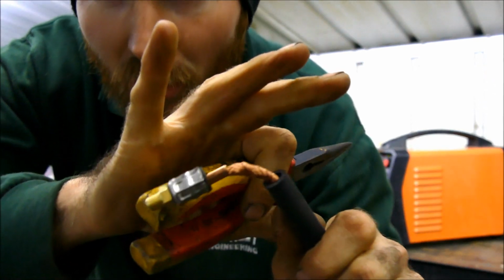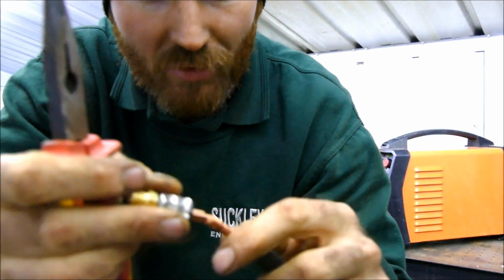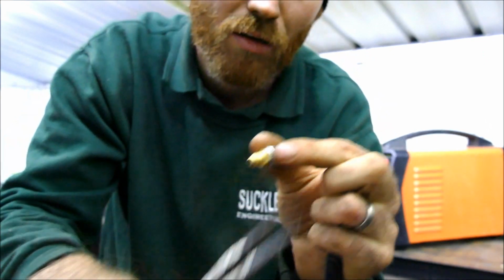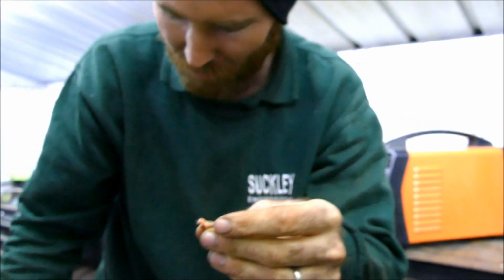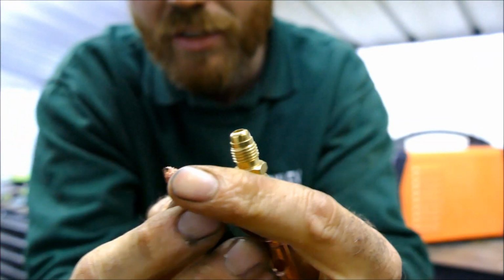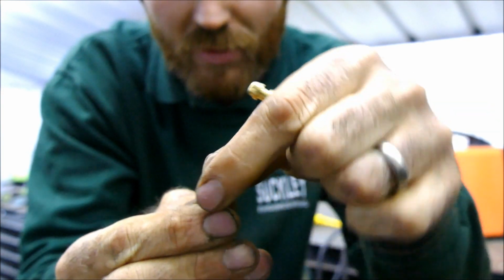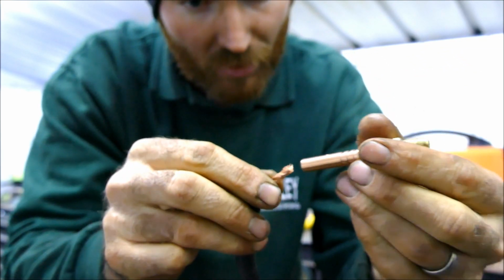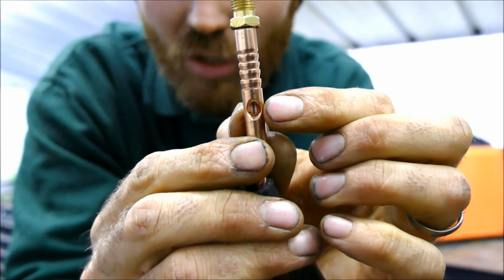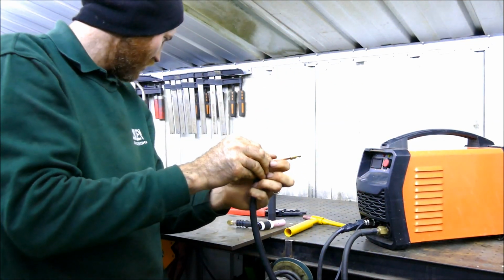There you go. So already I've got the Stanley knife and I've cut around the pipe just to reveal what was going on. So all I'm going to simply do now is cut the old part off, like so. There you go. Okay, so now with the copper braid and this part here, it will be described in the description. I'm not very good with technical names of stuff, if I'm honest. But that simply goes into there, but not past that little hole, because that's where your gas is going to flow through, so just enough. And I'm going to take the swaging tool now.